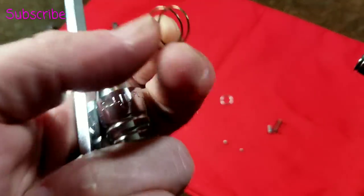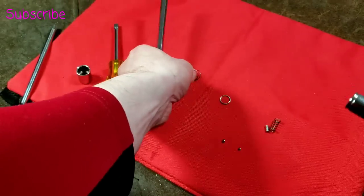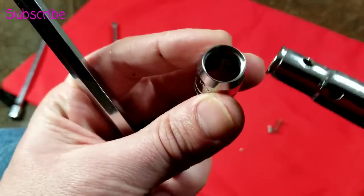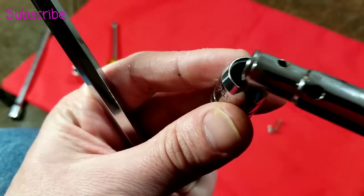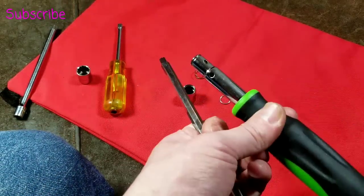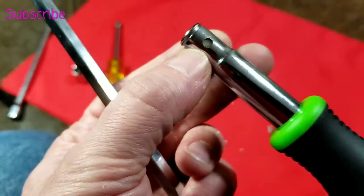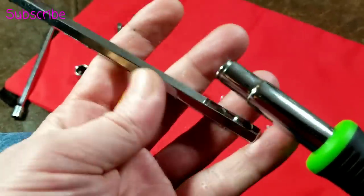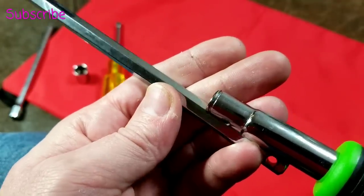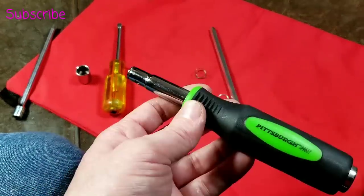This really kind of weird looking spring was like too long, so they just cut it — which could also be stronger — and it pushes the collar back up until the actual ring portion sits on top of the ball, preventing it from being able to pop out. There is actually a through hole at the top where the retention ball is, so they could have used a two-ball retention mechanism. All they would have had to do is make little divots on the other side, and that would have held it a lot more securely. It might have been nice to see them do that.